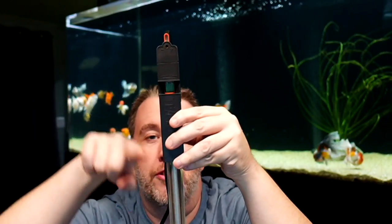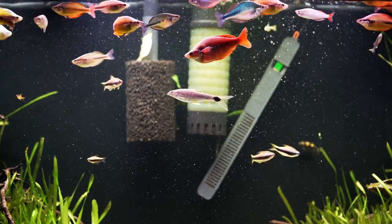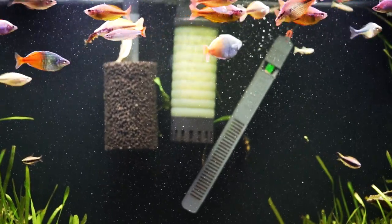It's going to prematurely turn on and off quickly because the heat's rising right around it. And so that's why we want this angle. Now, that's one recommendation, but two, get the flow going well. A lot of people say, my last heater didn't have to have that. Chances are your last heater didn't have a flow sensor. So it did need that, but that's why it failed.